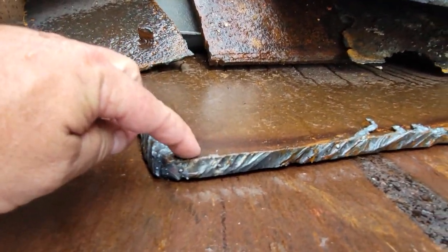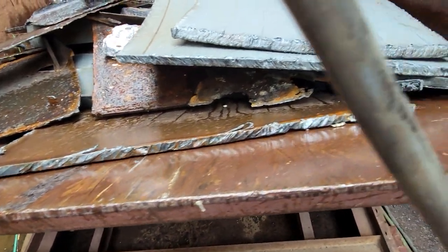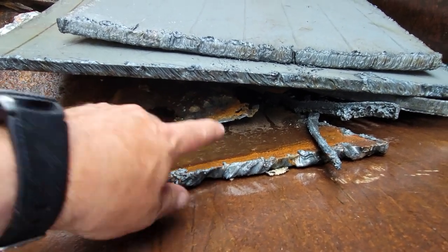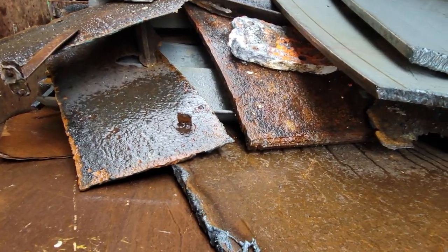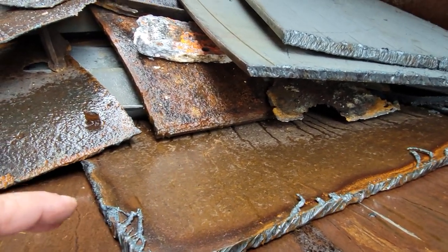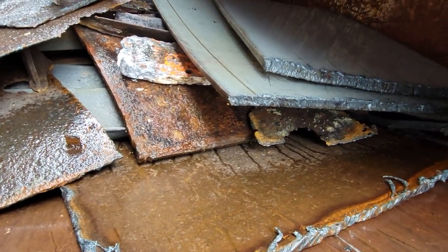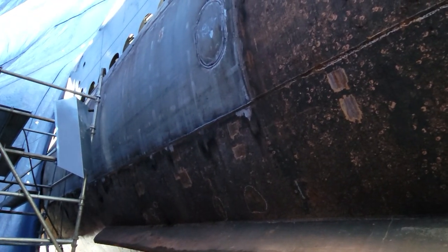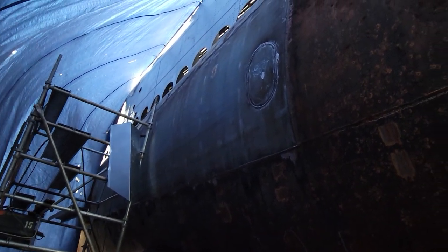Here's a section of the hull that was cut out. You can see the thickness here — we're looking at about a half an inch — and for the most part it looks pretty solid. There were some areas with pitting, but none of the pits really went all the way through, with exception of a few areas where we were removing, replacing, and welding those areas up. That kind of gives you an idea of why we decided for cost reasons to go with this epoxy filler, which works on large freighters, and we've heard from the shipyard that it lasts for a long, long time. As you can see under the tarp, one of our worst areas has been replaced — cut out and replaced with all new metal.